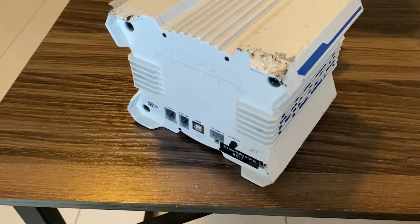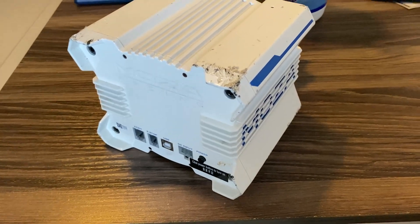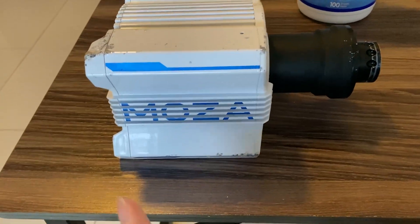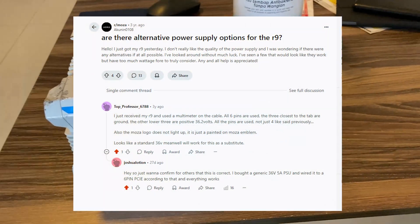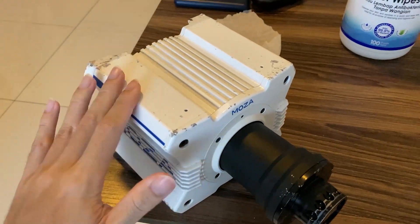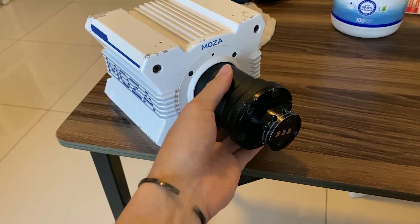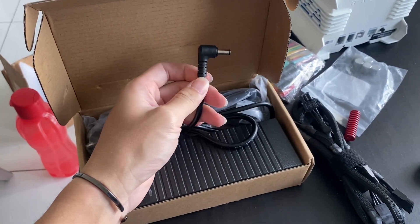Obviously the $80 power supply was a no-go, as it would be a total waste of RM300 if I bought it just to find out the wheelbase doesn't even work. So instead, I went online to find some info on how to build my own replacement power supply. However, the only lead I could find was a comment on a Reddit thread. Not only do I have to gamble on whether the wheelbase works, I don't even know if this random pinout provided by the redditor was going to be correct, meaning I could just end up creating some magic smoke. With no other course of action, I committed to buying a generic 36V 5A power supply, with the intention of salvaging one of my EVGA modular 6-pin cables to splice it with.